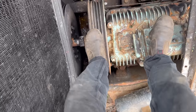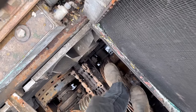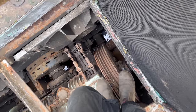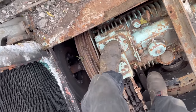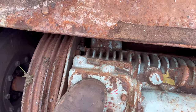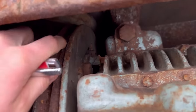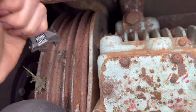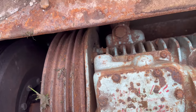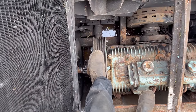You can see that should be turning freely. It is out of gear before anyone asks. Not that stupid. Pretty stupid, but I'm not that stupid. But they're stuck. So I'm going to wind off the slack adjustment on the back, if we can get down here without breaking a leg. Which is this thing here. I'm going to wind that off a couple of turns and then give this a good old tap, and then we'll see what happens. So with a bit of persuasion from the copper hammer and the adjusters off,